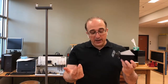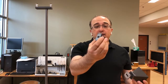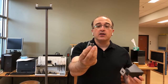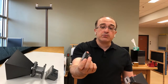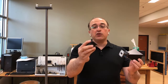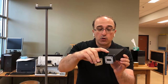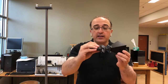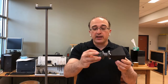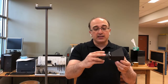To excite this horn antenna I need to bring the SMA cable to it, so I'm going to use this adapter piece. If you look at it, I have a waveguide and there is an SMA port, so I can bring the signal through this port to the waveguide system. Through these holes you connect the two waveguides firmly, then bring the SMA cable to the SMA port and excite the whole system.